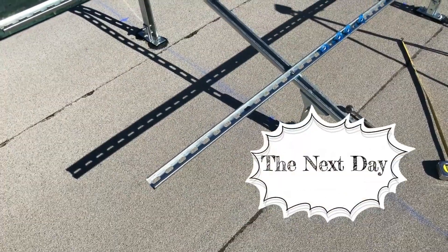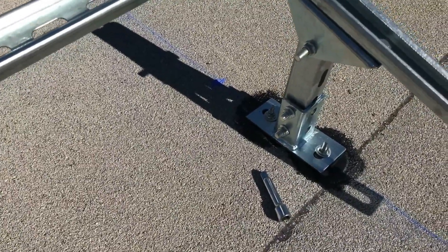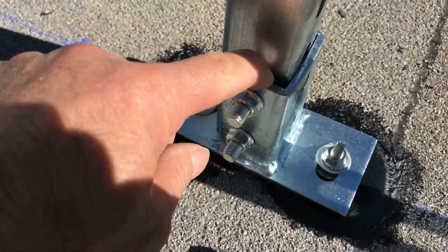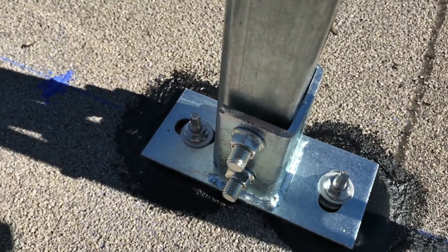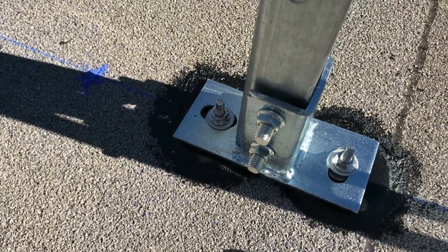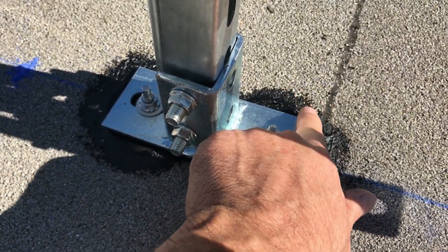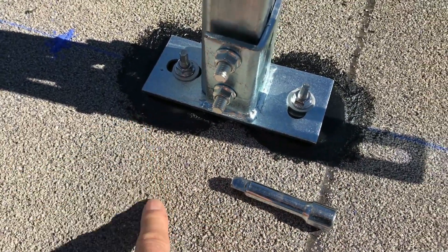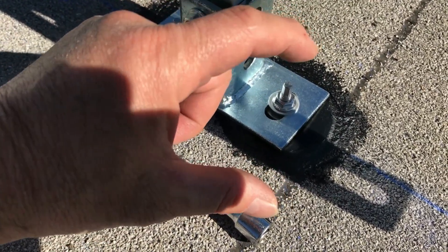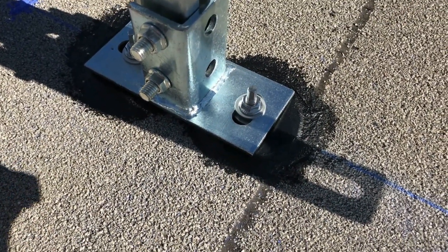I've finished the assembly of the racking system and it's pretty sturdy. The only thing I don't like is right here at the base — there's a gap between the base and the upright such that it doesn't stay perfectly snug, and hopefully that won't rattle too much during a severe windstorm, but it's not going anywhere. This is a pretty solid base and I've got all the bolts tightened down tightly. The micro flashing job — I put in a healthy bead of sealant all around and I think it'll hold. The lag screws that came with the Quick Bolt system were 5½-inch screws, and there is about a 2½-inch insulation layer under the roofing material, so that got me about 2 inches into the rafter wood — I feel that's pretty secure.